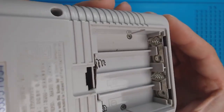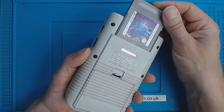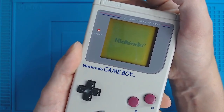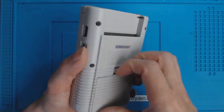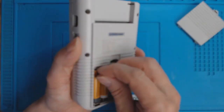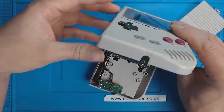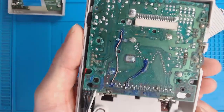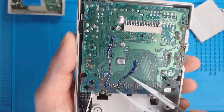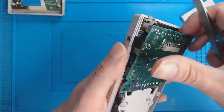The battery contacts are nice and clean, and that's where the good news ends. With Tetris we have a corrupted Nintendo logo. Now I've already done some work on this in the past — I've repaired some traces and I have had it loading games. I've repaired some traces: there's two here and one here, but unfortunately the front only gets worse.